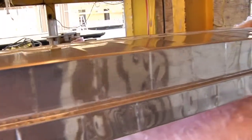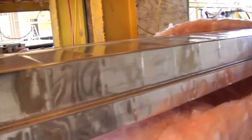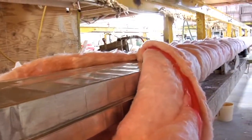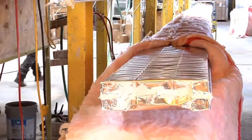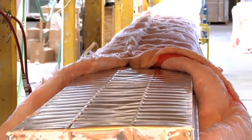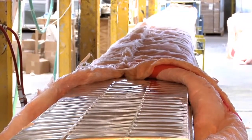The heating and air conditioning duct system in a Solitaire home consists of a one-piece aluminum trunk. We seal each end and all duct connections with sealant, not tape. Plus we add an extra step by wrapping the duct in insulation before installing it in the insulated subfloor.